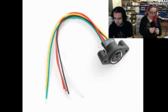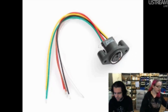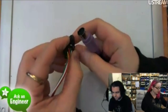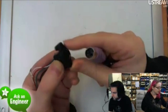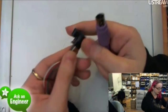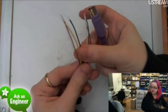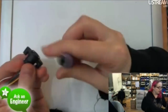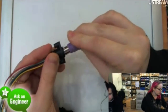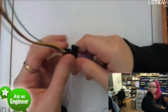There are tons of Arduino, Basic Stamp, and Propeller examples, so it's a really easy way to connect digital stuff like a keyboard or a mouse to a microcontroller. This connector is panel mount — there are two holes so it's easy to mount without having to drill extra holes. It's set back a little, so it can fit into a panel nicely. It's got colored wires, which makes it easy to use, and the product listing documents which wire goes to which connection. This is a PS2 Mini DIN 6-pin connector.